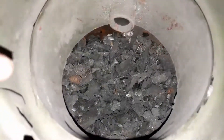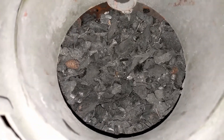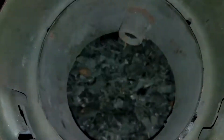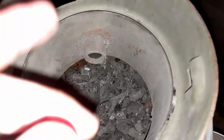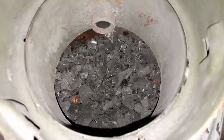Should I make a quick video showing the amount of drop in the charcoal level? This is after about 35-40 minutes of run time. Basically it's seven inches from the bottom of this pipe down to the deepest part of the charcoal. Because this is a five-gallon bucket, the rim is going to catch charcoal so it falls down in the middle first. The hose was almost mushy when I took it off, so I was right on the cusp of being too hot for the exit gas — but it ran for about 35-40 minutes, with both the flare and the engine running.